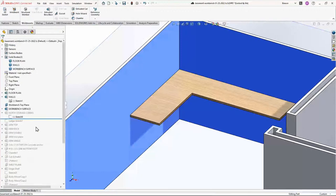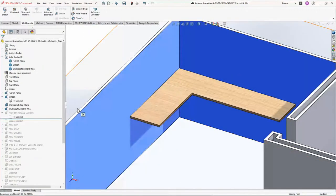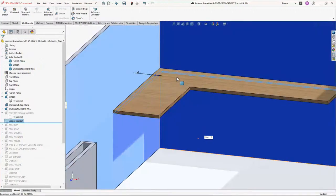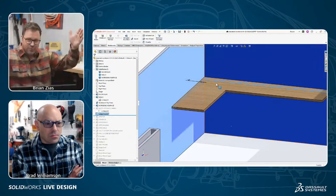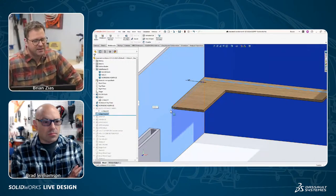Okay, so then I'm like, okay, great, Brian, you're almost done. And he said there's actually a lot of features I had to add. I'm like, this looks good. I could start building, but I didn't know how to approach fastening this to the wall. I watched a lot of YouTube videos where other people did. Some people just built some ledger boards underneath. But again, you can't see my wall, but there's this flashing of concrete that never would have worked. So I'm like, I can't go horizontal. I swear everyone on YouTube who does one of these builds uses a horizontal ledger board top and bottom. And it makes complete sense. But I'm like, it's not going to work for me. I need to get something more vertical.